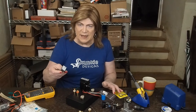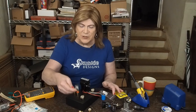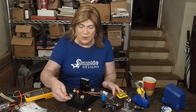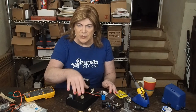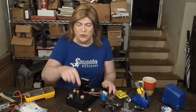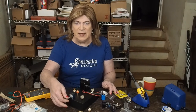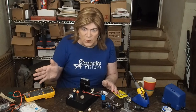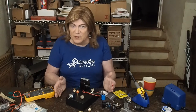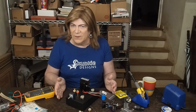One of the neat things I'm interested to see how this works is they're putting the volume control after the tube on the output. So theoretically, it should reduce the hiss or any noise you get from the tube. Because normally the full gain of the tube just goes straight to the output — on this, not only are you regulating the amount of music coming out of the preamp, you're regulating the amount of tube noise that goes with it, so it should make for a cleaner sounding output. It might actually be an interesting thing to try on an integrated amplifier — putting the volume control between the stages — something I've never even considered before.